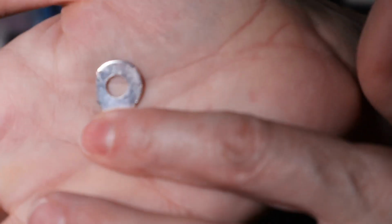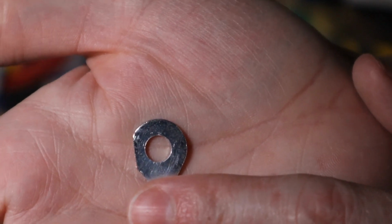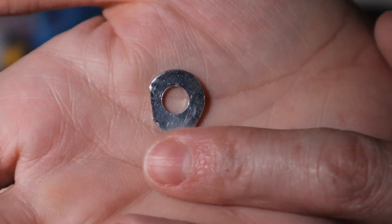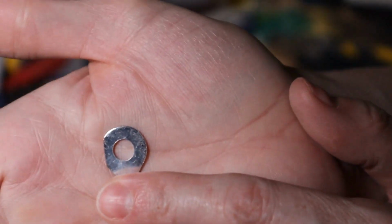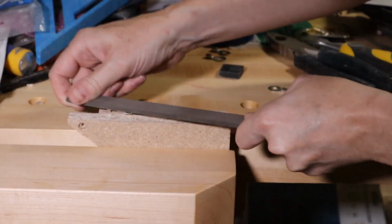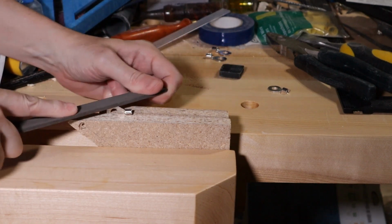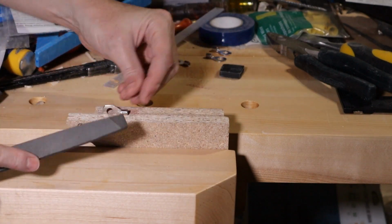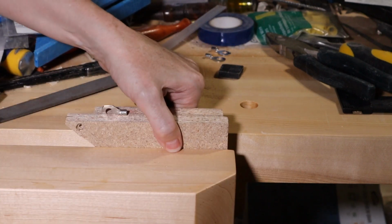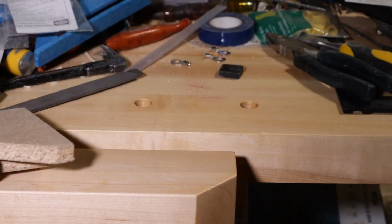Almost hit my toes. So you can see how much was taken off. The amount that's left is still wider than the bolt that's going to go on top of it. So it's not going to compromise the surface area for the conductivity to go through. And also keep in mind, these are for only 20 amps, which really isn't that much. AC amps. There, four modified ring terminals.